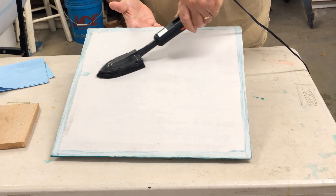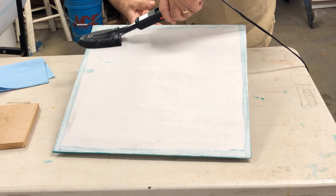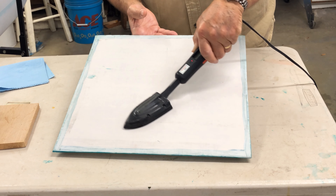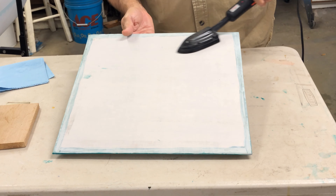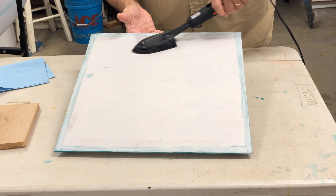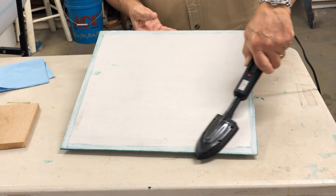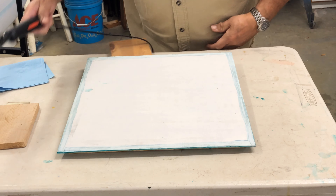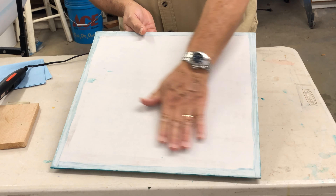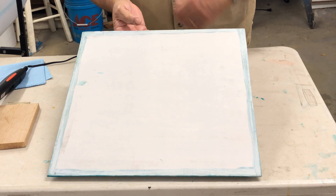One reason I would not want to go to 350 is if this were a fairly light wood frame — applying 350 heat could possibly warp it. I added quite a bit of bracing on the back of this so I wasn't concerned about that. On my doors I didn't have any concern about warpage either. That is going to be sufficient — you should be able to see pretty clearly there are no wrinkles left and it's nice and smooth with no bubbles. We're ready to go ahead and bond the glue to the surface of the plywood.